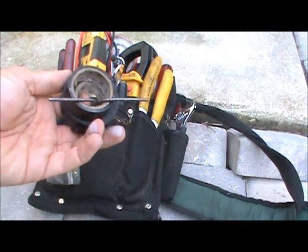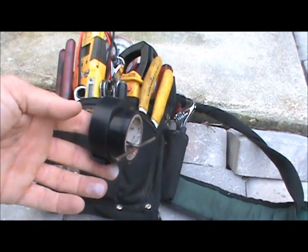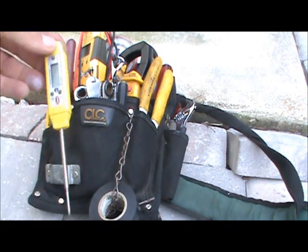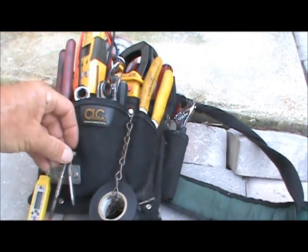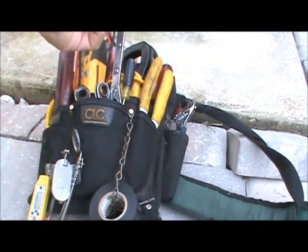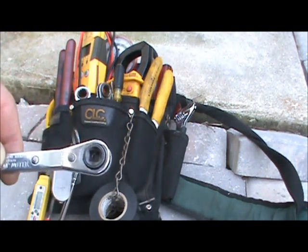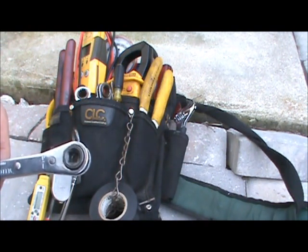First thing, it's got the electrical wire holder there, so I can keep a couple of rolls on there. I have just a basic digital thermometer, a couple of inspection mirrors, and a service wrench that you get at the supply house. This is for the manual service valves — usually you'll find them on really old systems or commercial jobs where you have to open up the service valves to measure.